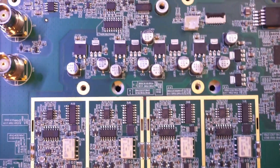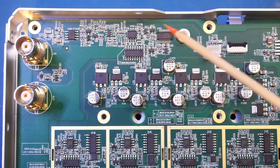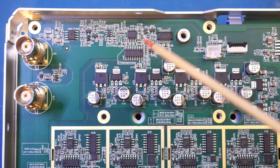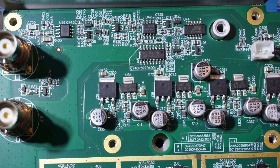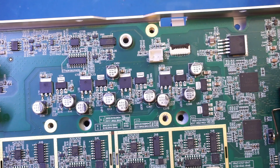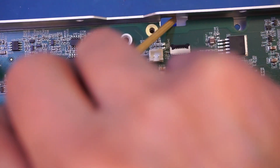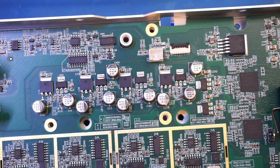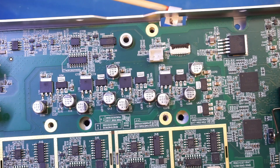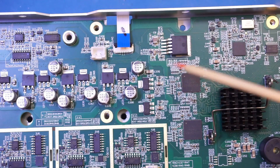Moving down, in this section we don't have a whole lot. There are some op-amps — these are the TL071s — and we have a shift register. These here are actually linear regulators, so nothing particularly interesting. This is the connector going to the front panel via a ribbon cable for your controls, and clearly that's a serial protocol as we only have a few connectors.